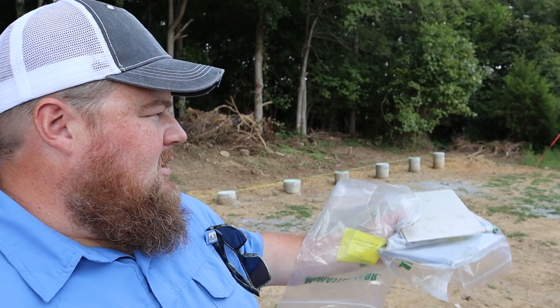Well, that's a bunch of awesome sauce right there. If you didn't know what awesome sauce is, it is some aluminum stock on top of concrete piers out in the dirt to make everything nice and level and ready for install. So I ended up buying a 1 5/8 thick piece of stock. I went right up here, filled up that gap perfectly nice and level with that string. And then I used two 1/4-inch ones on this line and two 1/4-inch thick on the back line.